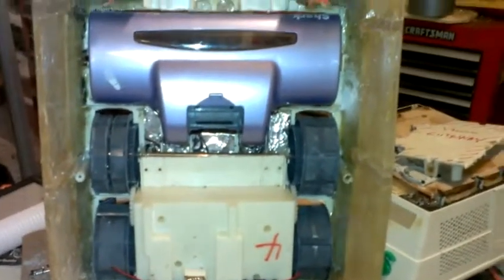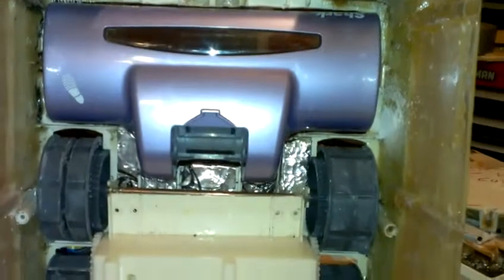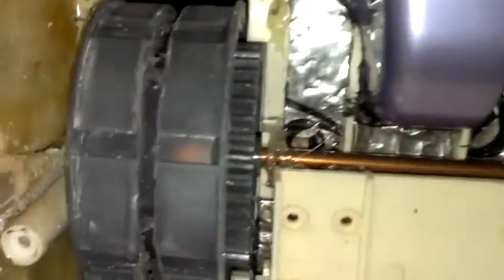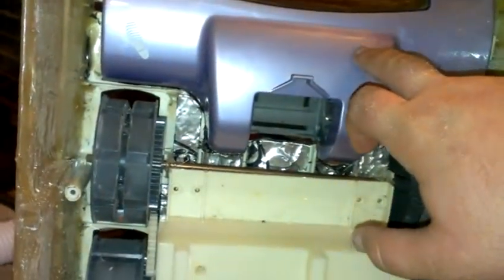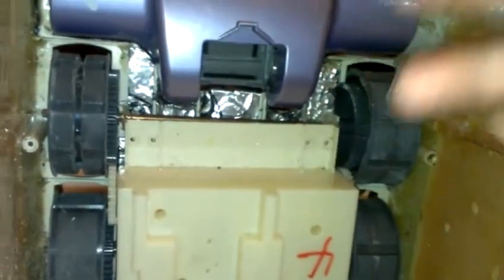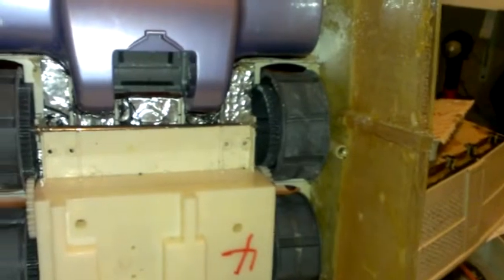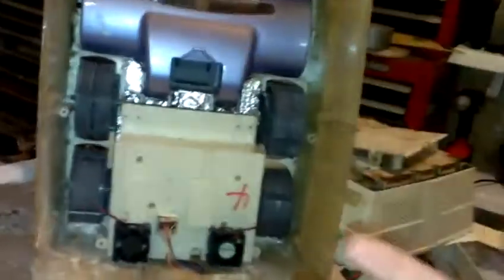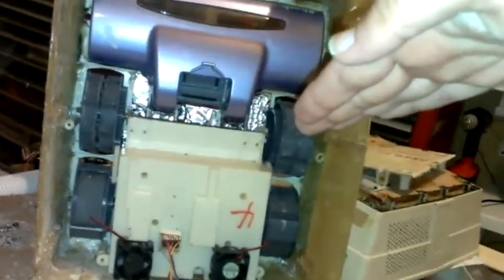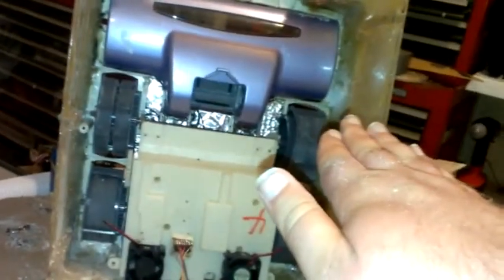I hope everybody enjoyed this video. I'm uploading the other one right now, and in my next video I will be epoxying this thing in place. Right now I'm using a little bit of hot glue to hold the axles in place to make sure the wheels are where they're supposed to be. I will have to go ahead and adhere the treads back to the wheels because I need to make sure that when I actually mold this back in place, it sits perfectly level with the existing wheels. That ensures that not only the robot doesn't ride tilted backwards or forwards, but also that I have the correct angle on the brush so it's actually getting carpet. If I don't, the brush will actually either be tilted and not touching the carpet or vice versa, and it would also cause the whole robot to be off balance.